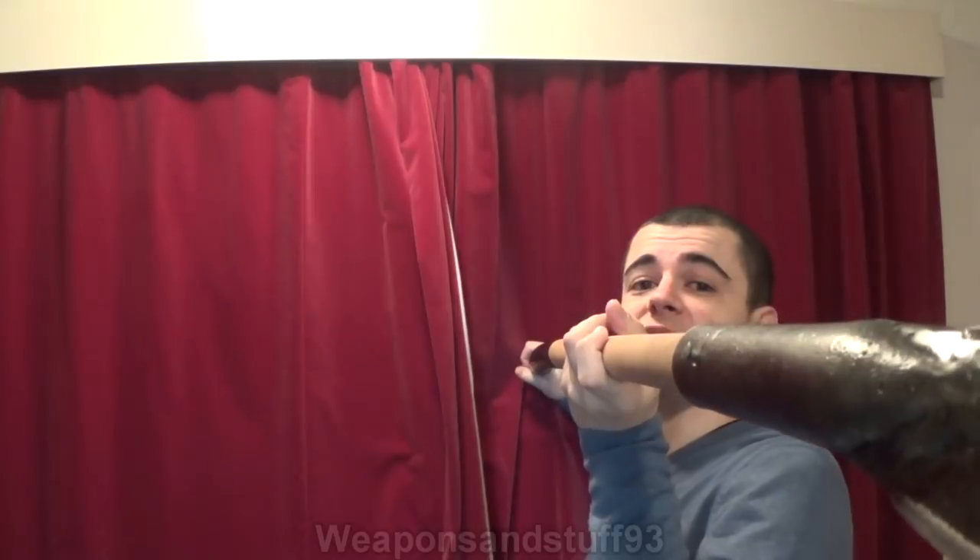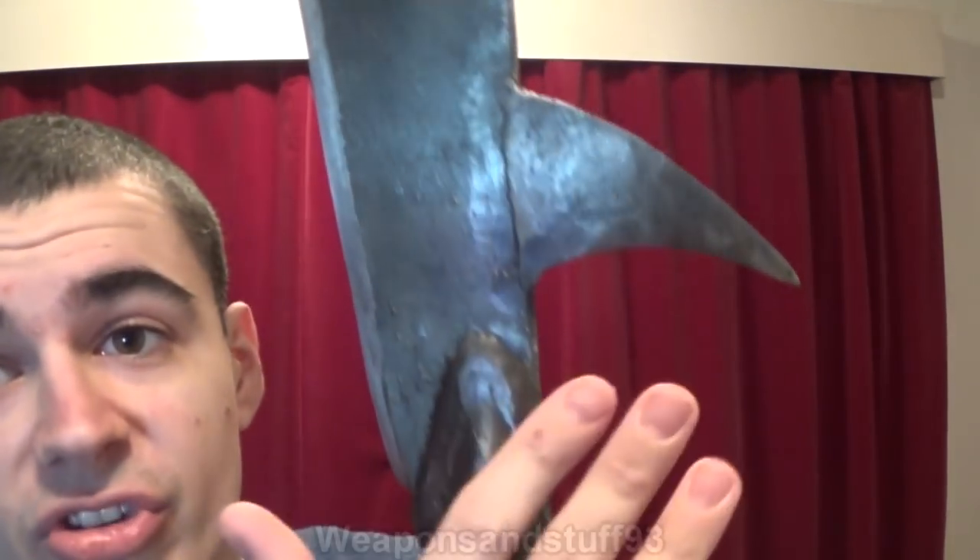So what I'm going to do now is take this out into the garden. I've got a bit of cardboard box left over — one of the really strong rigid shipping cardboard boxes, not a flimsy one — and I'll thrust through it a couple of times and hit it. Now, I know this billhook is built to a very good standard, so any stuff where it doesn't work properly will be me, not the billhook. Another thing to point out is Richard, because he obviously knows what he was doing, made this using two kinds of carbon steels: one that's better for the spike — it won't stay as sharp, but it's very good for a thrusting spike since a spike doesn't need to be sharp, it's a thrusting tool not a cutting tool — and a different kind of carbon steel for the edge, one better at keeping an edge. And as you can see, he's done very solid welds to get those parts onto there. So anyway, let's go and test it.